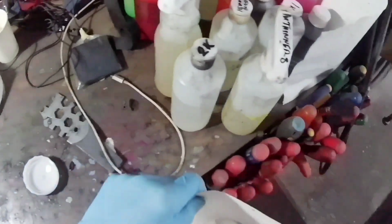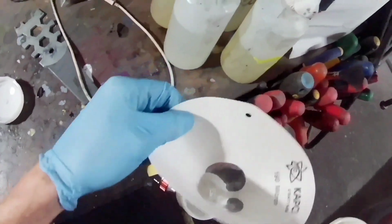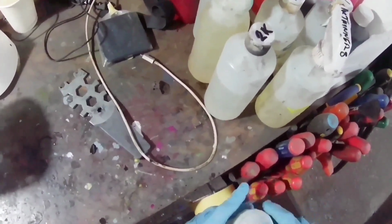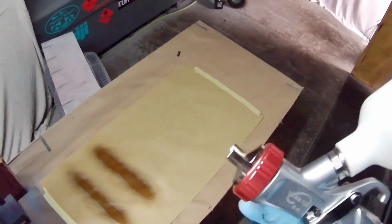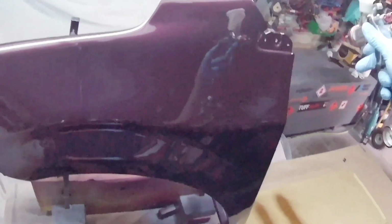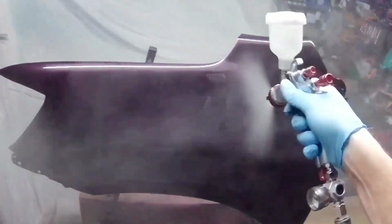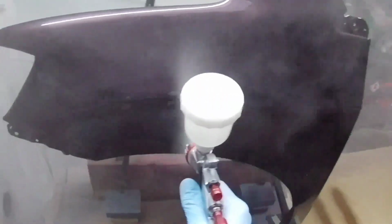If you think to yourself about 8 CFM of air, you would be right, which ironically is right in the middle of those two figures that I just quoted you, that I saw on AliExpress when you see these things for sale. I think the Drizzle is sold as an LVLP gun. I always question sometimes whether LVLP actually exists. As I've said before in my other videos, it's a bit like Utopia, isn't it? You think you've found something that will give you a superb finish, hardly uses any air, very competent gun, not expensive. It's sort of like the ideal thing to have, isn't it? And I question whether they actually exist. Obviously you get some guns that use less than others, and this is one of those guns that use less, but it certainly doesn't use less than a MIDI or a mini gun.